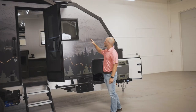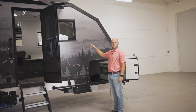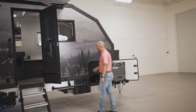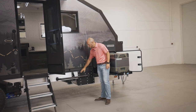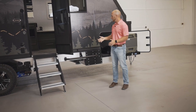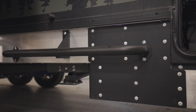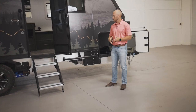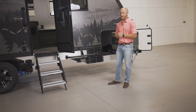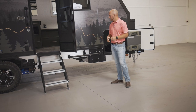Here's another one of those dual pane acrylic windows, just like we have on the front. Looking down, I want to spend a little time on this — our aluminum frame. The aluminum frame is actually huck riveted, meaning there are no welds on here whatsoever. We take all the human error out of welding and put in huck rivets. They are put in by machines, very consistent day in and day out. You don't have to worry about any welds cracking.